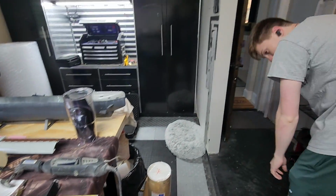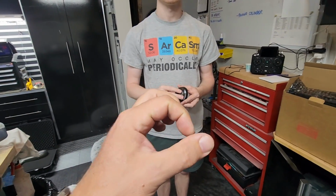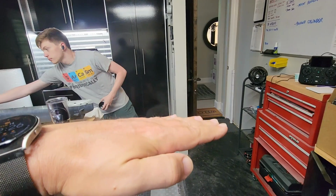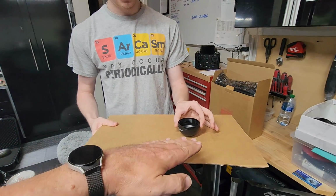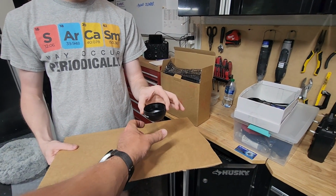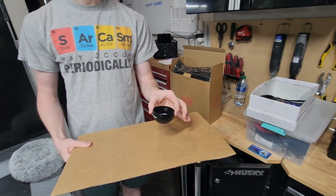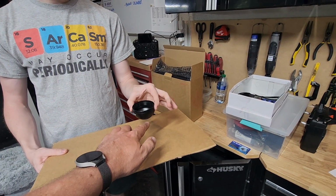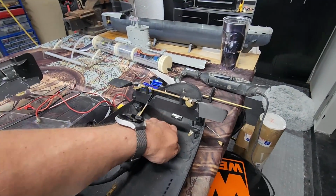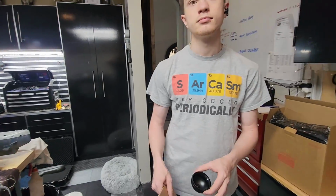Now what Logan is going to do is he's going to conduct more testing. He's going to need that. We want to cut a 1-inch hole. We're just going to use cardboard because we're cheap here. And we're going to hold the cardboard underneath the sonar. Well, he's going to demonstrate. And we'll slowly lower the cardboard until the signal starts doing wonky things. So we're going to put it on the 7-degree arc, and we're going to see at what point the signal gets all screwed up. If we can go about 4 inches, that would be more than enough for this to work with a 1-inch hole in the bottom of the hull, which you would never ever see. We could even go bigger. We go 2 inches if we wanted to. We could do away with the whole testing thing and just cut a 2-inch hole.